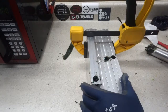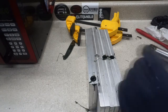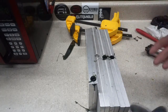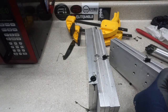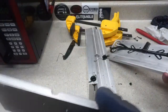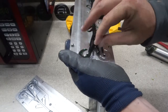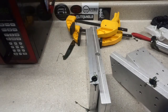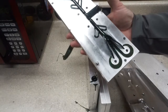One question a lot of people ask is: how long can you leave plastic in the mold before you need to tear it apart? That depends on a couple things. How hot are you shooting your baits — are you shooting them over 350, or around 300? And the other thing is how hot are your molds? That was my first shot — it's probably been about a minute and I'm ready to pull them out, because the molds are cold. Here's your brush hog. The other brush hog mold — they usually don't want to cooperate. Must have said something right.